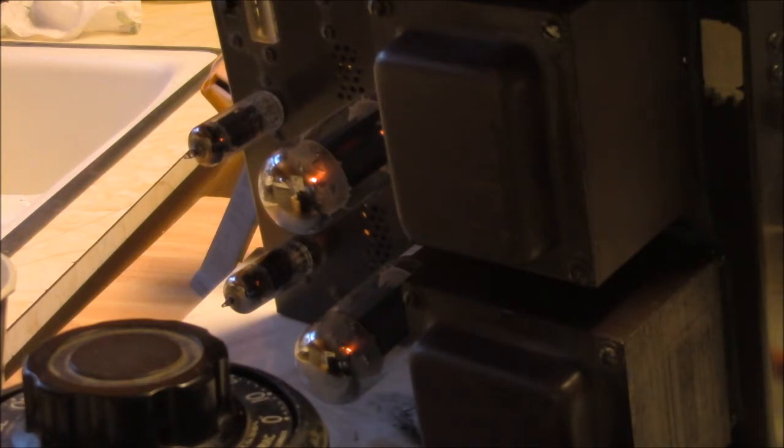On the flip side of that coin, personally, if you run the tubes a little harder, leave a little skin behind, traditionally the amps sound a little better, but it's a perceptional thing. You really ought to do what the tube manufacturer recommends, and actually look at the plate dissipation. What's happening there is that the plate can't dissipate all the heat that's crossing through there. That's a combination of how much current you're drawing and how much voltage is on the plate. Since we're running this at about 120-some volts, and it was probably designed for, I don't know, 117 or 115, there's a little bit of an issue.